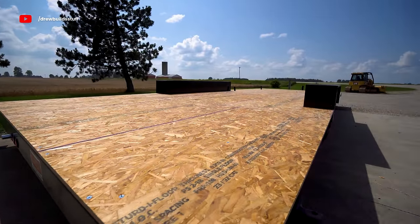So once I got to the middle board, this board's gonna have my first light in it, so I drilled a 2.5 inch hole, which is the right size for the pot light that I have. And these are just an indoor-outdoor pot light, and these have a gimbal so I can actually angle these down. So after making sure it fits the hole, I took the board up to install it.